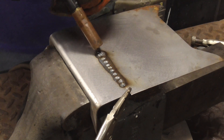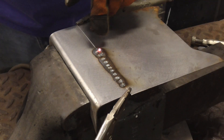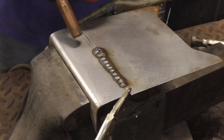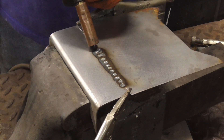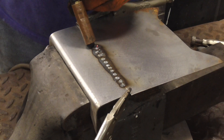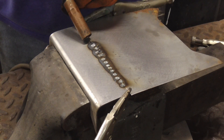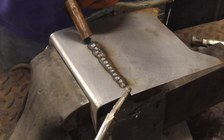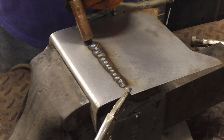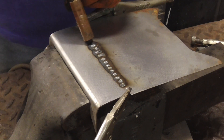Start out here, roll it, turn it into a stitch weld. Now that one's got a little bit of a weird thing that happened to it — we'll do it again. That one's better. I think I had too much of an angle. We're going to go more of a 45-degree angle. Use that lap as a guide, hit it, hit it, and twist.